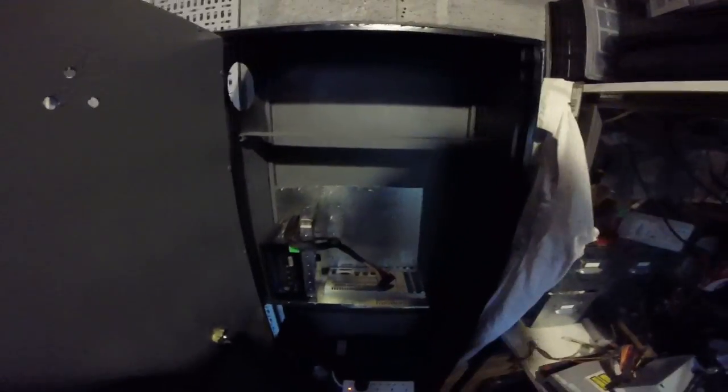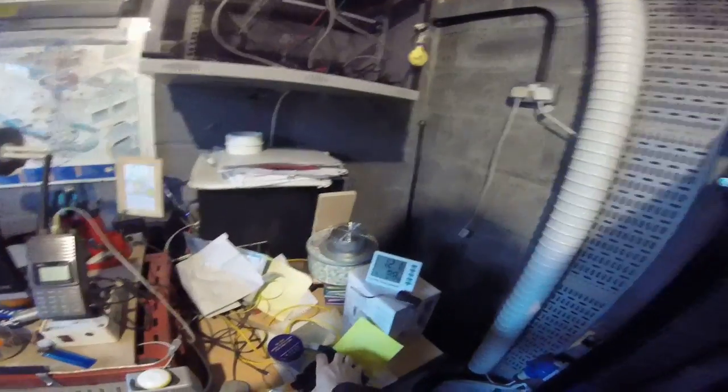Now this is my next project — to finish this bad boy off. As you can see, it's already got an enigmatic glowing neon light on it. There's a proper power inlet which is all nicely plumbed in with cable management inside, a UPS, power distribution, and here is a chassis plate which is going to have a motherboard mounted to it. This plate is drilled to put an aluminium plate in there with cutouts to bring out VGA, USB, and Ethernet sockets. I'm going to be mounting a fan and a flange spigot so that air inlet brings in nice fresh air from outside that isn't full of nasty workshop dust. Air will be sucked in and blown down into here so this container will contain air which is relatively clean and at higher pressure than the outside environment.